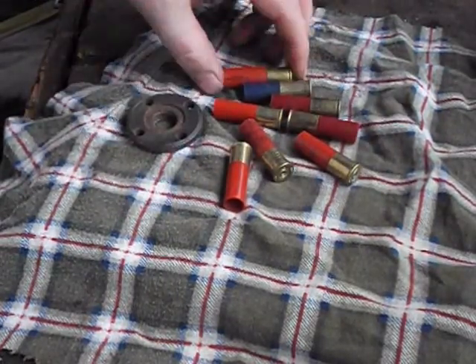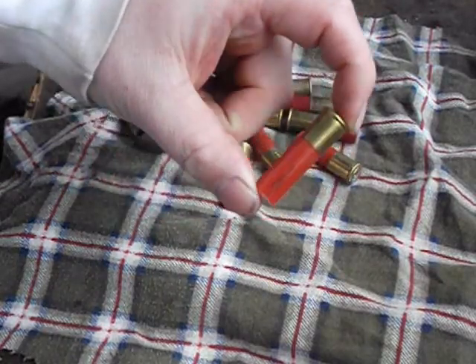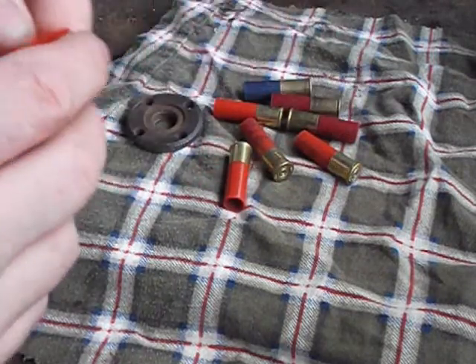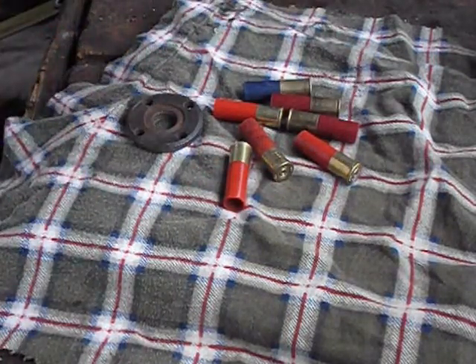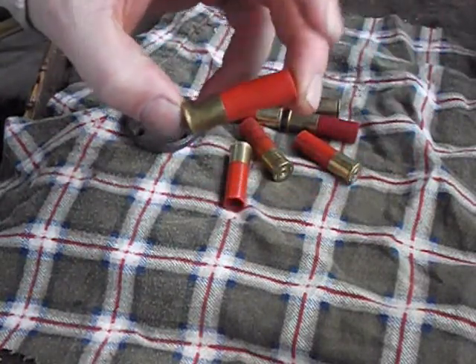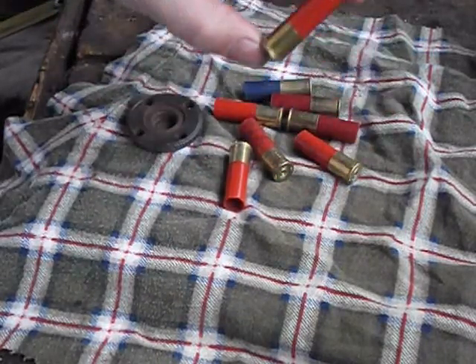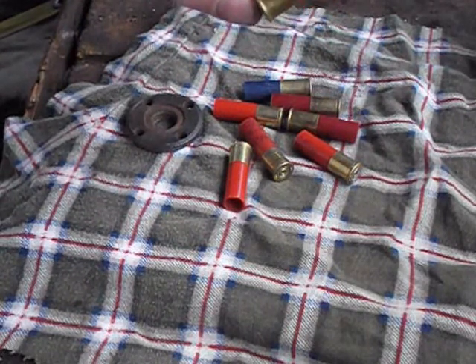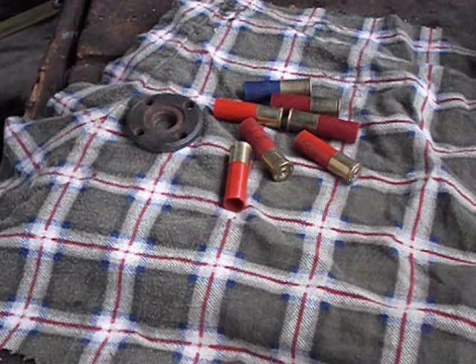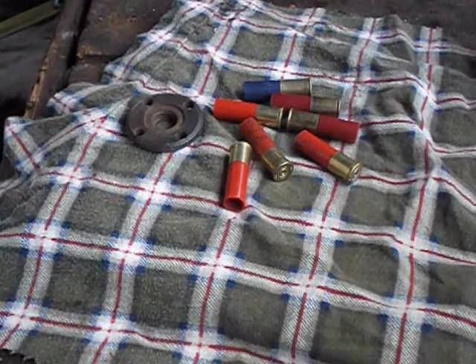I got a few comments on it right away so I thought there might be some interest. I'm starting off with a .410 shell cut down to 1.6 inches, or 40.6 millimeters. I picked that length because it's the maximum overall loaded length of the .44-40 and the .45 Colt, and probably others as well. I'm trying to get my hands on a .44 shot — that'll take these, and .45 Colt will take these, and .410 will obviously take these.